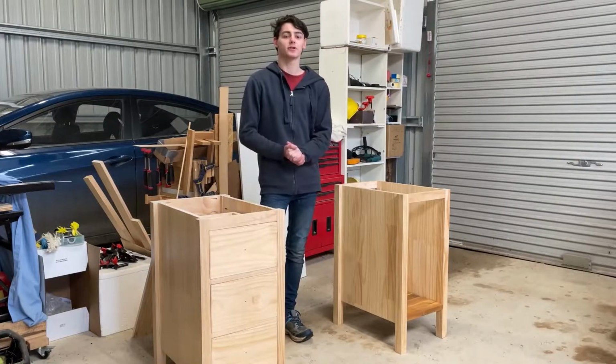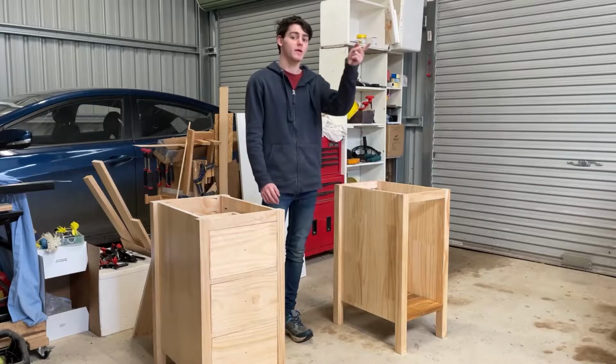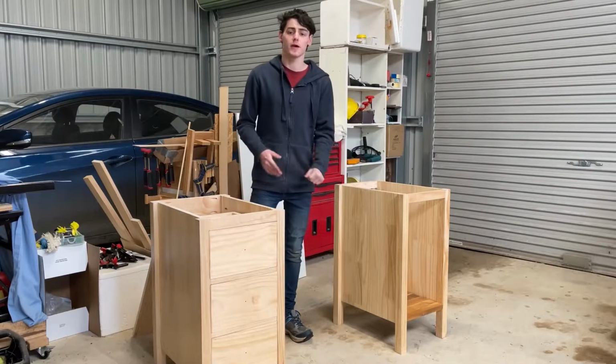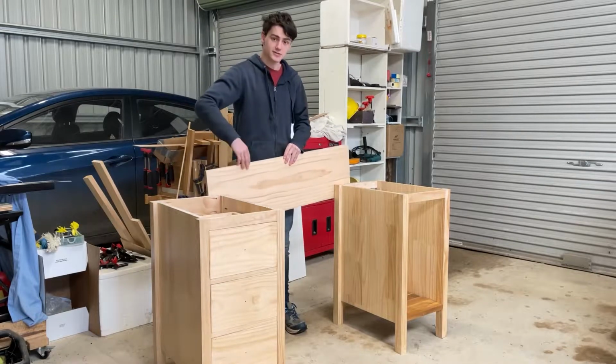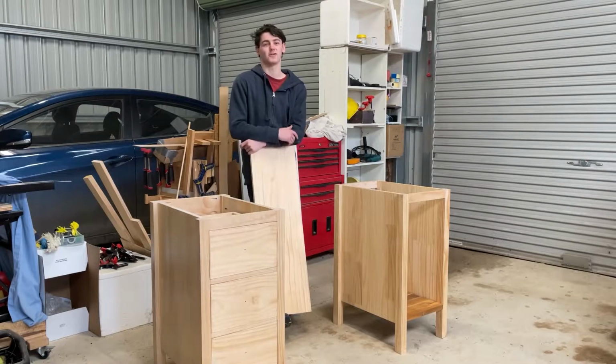So here's the main components of the desk. We got our drawers over here and our computer stand over here. Timber bench top is out of frame over there, but we are forgetting one part because I forgot about it. And that's this back support here. We got some pocket holes at each side, which we're gonna screw on in between the two carcasses here, just to give it a little bit more strength. So we're gonna do that because it's time for final assembly.